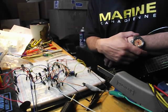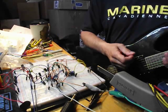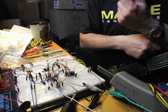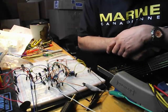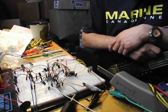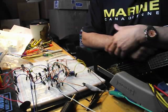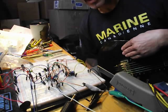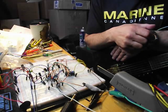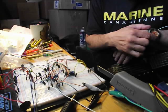The circuit's become a bit tamer than with the LM394. Taming the octave section actually helps the fuzz. The arpeggio artifacts on the decay that I talked about in my first video actually come through a little stronger. The octave is still pretty decent, although because it's tamer, when you turn up your drive, it doesn't tend to overpower the fuzz like the 394 does.